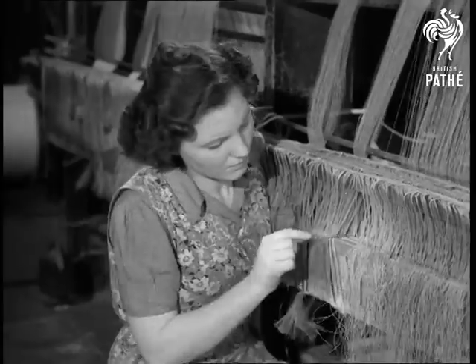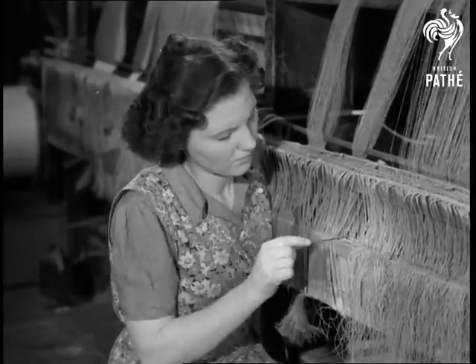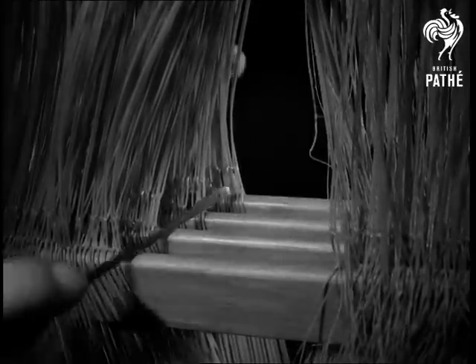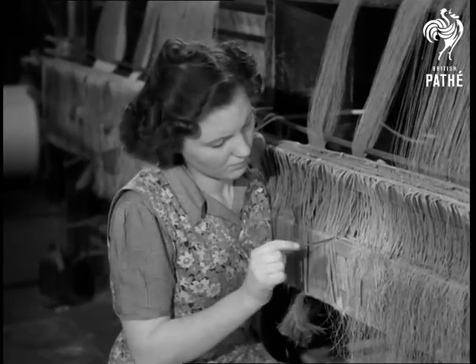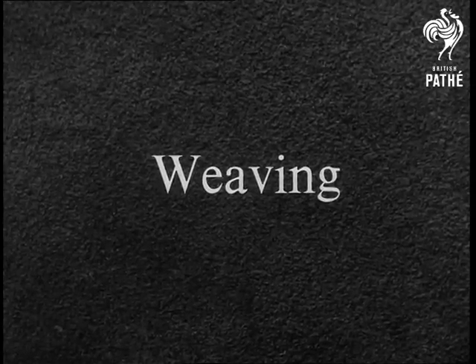This tool is held in her right hand. The left hand is at the back guiding the threads. The hook draws them through the eyelet hole in the wire and the threaded wires are pushed along the heddles to the right. Heddles are threaded and perns all wound.